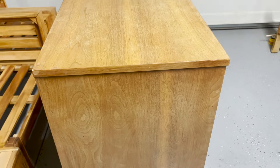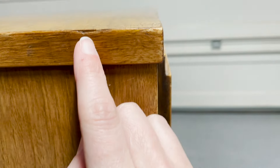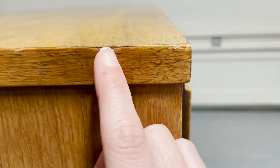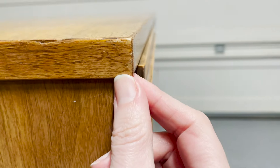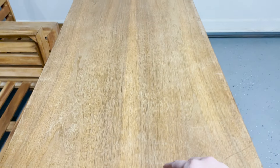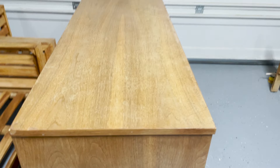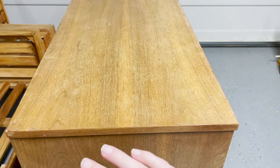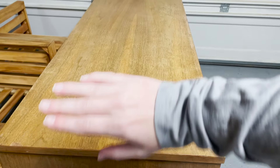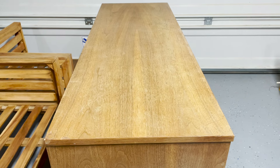Now this piece is a little bit different. This one was actually very hard for me to tell exactly what it is, but I believe this one is a veneer. See how there's not a lot of color fading? The other difference is when it chips off, it still looks like wood underneath. See the wood grain — it goes all the way down the top of this wood. The way they would do that is just lay it all flat and glue it down. That's a good indicator that this is actually a veneer wood.